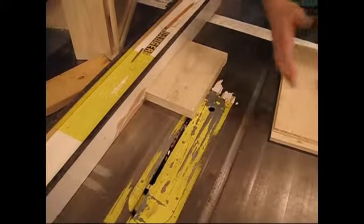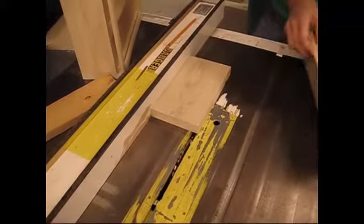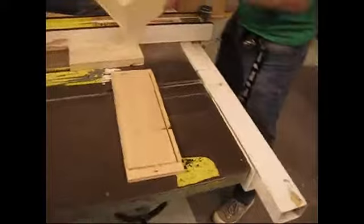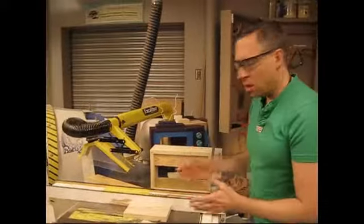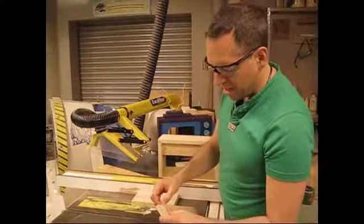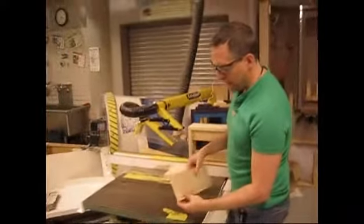Now if I had my 4 pieces, I actually discovered one key aspect, and that is cutting down the back side to allow me to put a backing on it, really helpful. But it's even more helpful if I do that first. So that would be one of the first things that I would do, and it's a good idea again. It just makes it nice and neat if you do the same depth as you've done your rabbet joints on the edge, okay?